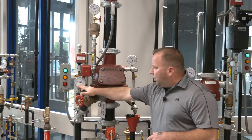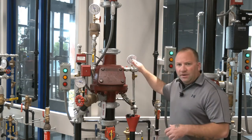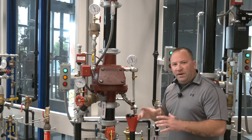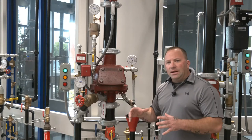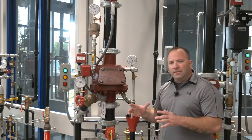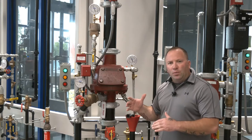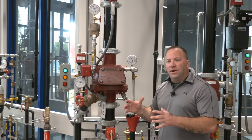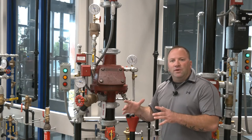With our city water pressure on the left side of the valve and our air pressure on the right side of the valve, you'll notice there's less air pressure. That's the six to one differential that occurs inside the valve based on the surface area of the clapper that holds the water pressure back. The air side of that clapper is larger than the water side — about six times larger — so it makes the air pressure in theory a little bit stronger than the water pressure. Pressure is pressure, so the air isn't really stronger; it gains its strength through the size of the clapper assembly itself having more surface area.